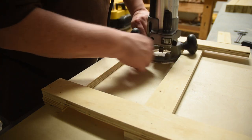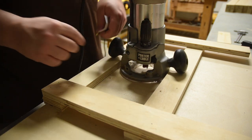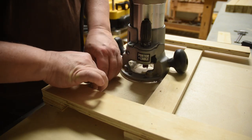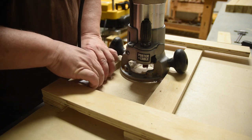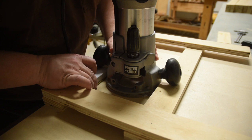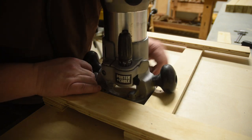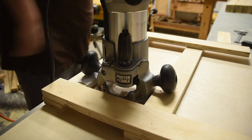So I got 5 nails on that side. Bring this back down. Recheck it here. Business card, brass. Slide it so it compresses down, doesn't push over that way. And yes, I have a nice tight fit on this side. So I'll put my 5 nails over here.